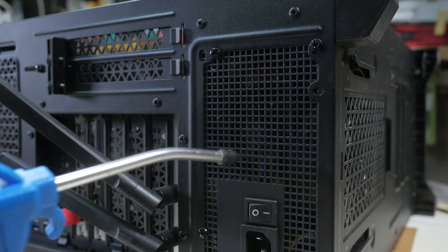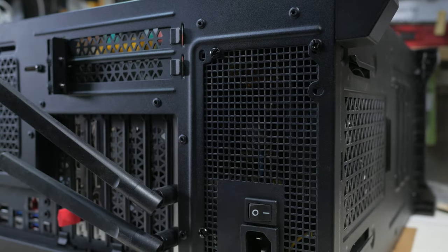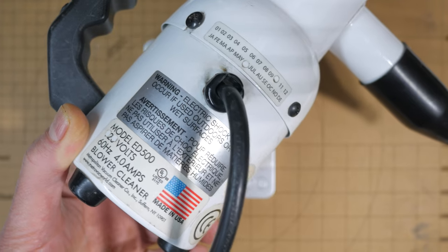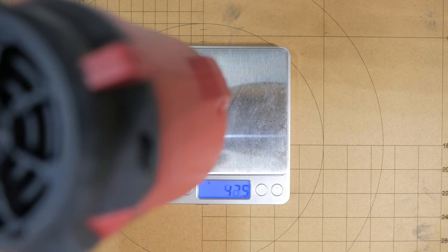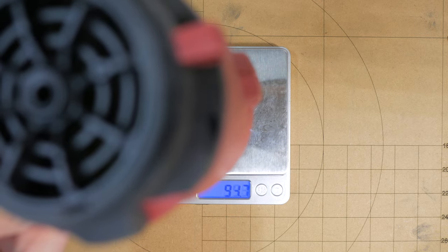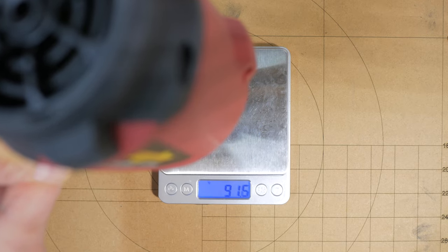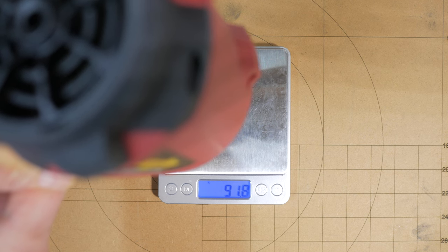Then it is entirely portable which makes it very convenient. To visually show how it compares to a SIP 100 litre 14.6 CFM compressor, canned compressed air and my electric blower, I used small digital scales to measure the force of the dusters, directing the jet of air around 2cm away. I used a similar size roughly 7mm nozzle for the Melef, compressor air blower and electric duster. That wasn't possible with the canned air, but I used it without the straw which resulted in about a 3mm nozzle.